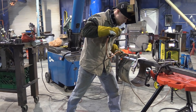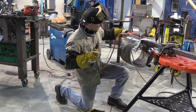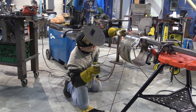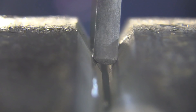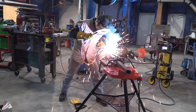Strike — keep it 90, keep it 90. Come down, come down. I've got to make sure this is not going to get hung up. Strike into this and then I'll probably reposition myself. Keep it 90. This shows the challenge of using a 5/32 rod on a root like this — it's a challenge to get it jammed in there tight enough to get full penetration without undercut on the inside toes. You can hear it start blowing through the backside, keeping the arc nice and tight.